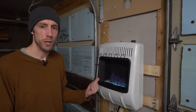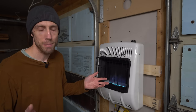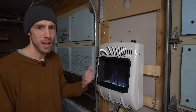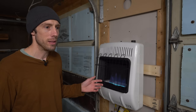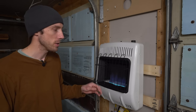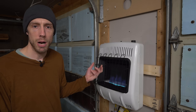There are some downsides to this heater. First, it is vent-free, meaning all of the gases go right into your workspace. Some people are more sensitive to the smell of propane burning — I happen to be one of those people. You can definitely smell it. It's not a propane smell, it's a propane burn exhaust smell. I personally can't deal with that smell for too long or I'll start getting headaches. I have CO detectors everywhere — the actual ones that give a readout, not just the ones that say zero all the time. These are completely safe to run indoors; they have low oxygen shutoff.